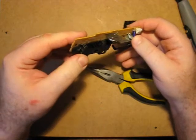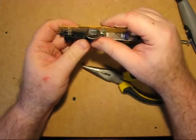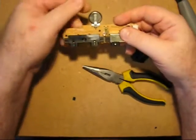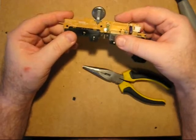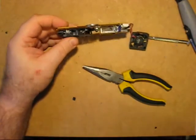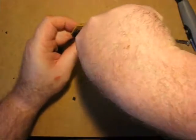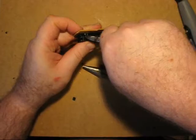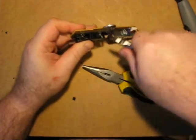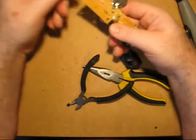You can use the Dremel, which is a good idea, except of course here you've got the battery. It would be a good idea to actually just desolder this battery or remove it out of the way. Again, on the Dreamcast they're not soldered in that brilliantly — you can easily pop it out and pop it back. So we can either use the Dremel or we can go in here and snip the pins — whatever you feel like doing, it doesn't make much difference. What you're trying to do is just to dislodge these parts so that you can then take the board off.